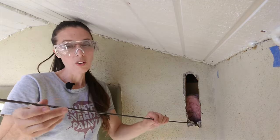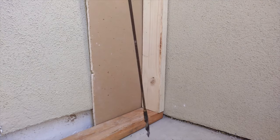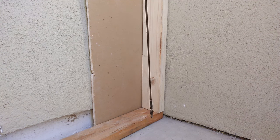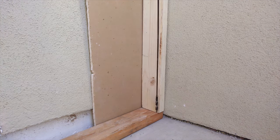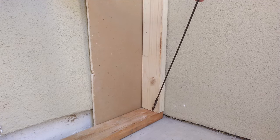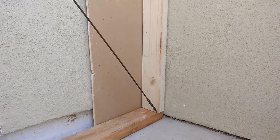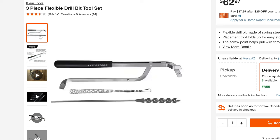Here's a mock-up of what's going on inside the stud wall: the back of the drywall along with two studs. When inserting the drill bit it's going to naturally want to walk to the inside corner of the wall, but we want it along the outside. You don't want the angle driving it into the interior wall. Instead, you want your drill bit angle to be parallel to the house so that when you apply pressure it goes straight down into the stud along the outside.